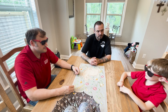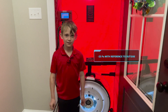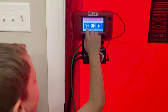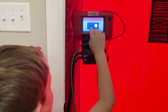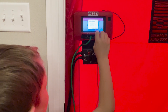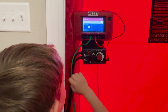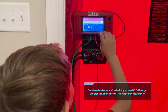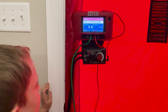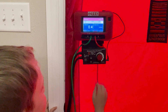Nothing good. You ready to go to work? Let's do this. Now we're going to turn on the blower door to get the house down to negative 25 pascals of pressure. We're going to hit tubing assistant, building tightness, and depressurize inside the building — model 3 fan — continue, and we hit play. Now we hit set baseline, hit enter. We've got to change it to flow 25, so we're going to turn on the speed controller and hit play.